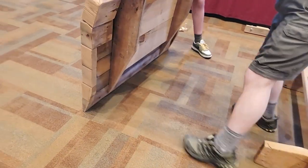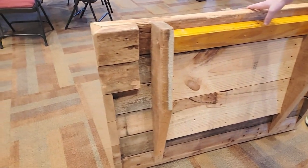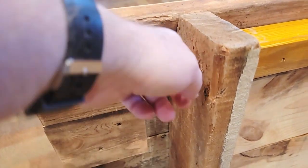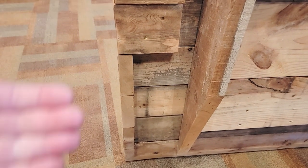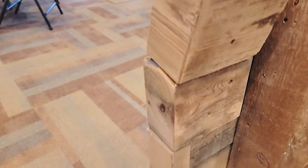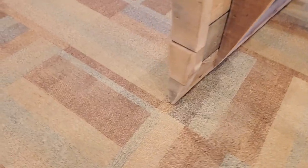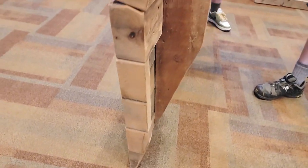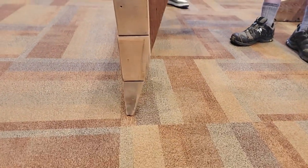The actual ramp itself on the bottom — we probably over-engineered this. You don't need this much wood underneath. What we did is created this little gap right here so you can slide the structure in between. You can only return so many of these, and as you get down towards the bottom there wasn't space, so you can see that we just cut those off so it sits right next to the ground. At the very bottom, you can see that we created that wedge right there, and that lines up with the actual joist.